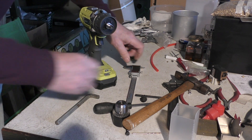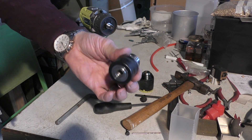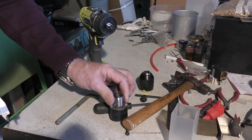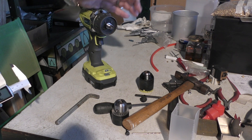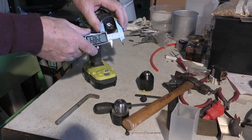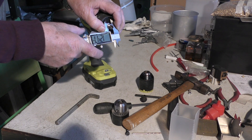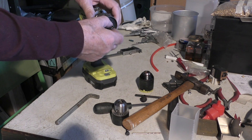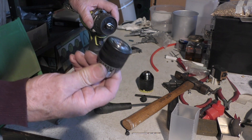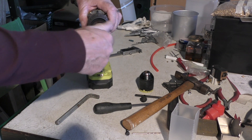There's the thread I was telling you about. It's always worth removing the chuck before you buy a replacement because there are basically two sizes — two standard threads that these drills have. A smaller drill will probably have a three-eighths thread, but just to be sure, check that this one, which is a half inch, has a half-inch by 20 TPI thread on there. If you look at the specification for these chucks, you'll find that they're half-inch 20s, so this chuck will fit perfectly on that thread.